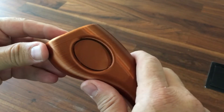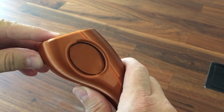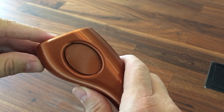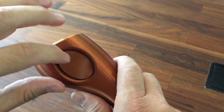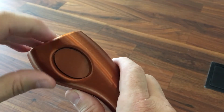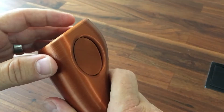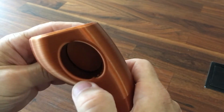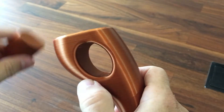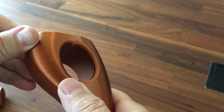So I built a custom support into the model. This is the PLA piece. I knew I was printing at 0.16mm layer height, so I left a 0.32mm gap — basically double the layer height — and I just built this piece into the 3D model and printed it. It took a little bit of work to get that plug out, but that plug is a throwaway, and look at that really perfect finish.